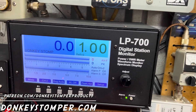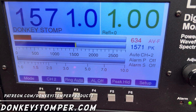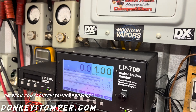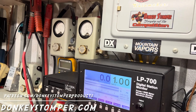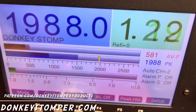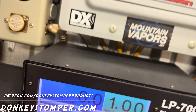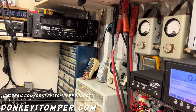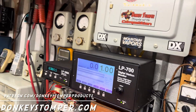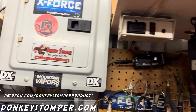Turn down the carrier — now look at the average: about 250 on sideband. So what you've got to do is actually run it easier on sideband than on AM. Watch that average number on sideband — if all the numbers are doing 700 average on AM, you really want to do less average on sideband, and then your transistors will stay working. That's just a little trick I've learned — may not be textbook but it works.